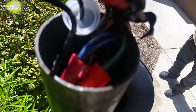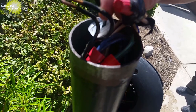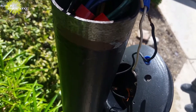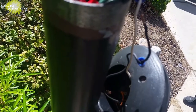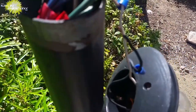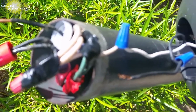Always practice safety — use a circuit alert device. Don't work on circuits live; turn the breakers off. Know what you're dealing with and don't touch anything if you don't know. Use the circuit alert device — it can save your life. It alerts you if there's actually current present, because you can turn off one breaker and there may be other wires fed through the same junction boxes or conduit. Be aware of that.